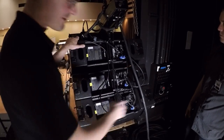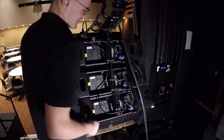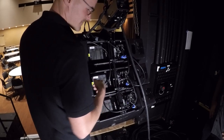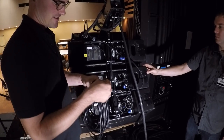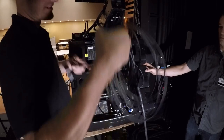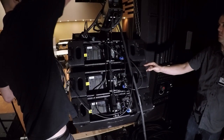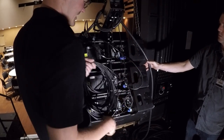Put it in, twist it, boom — we got power. We don't have the power hooked up yet, but the next step would be to fire these on. Switching them down is going to turn them on. It's always good to send signal to them too, make sure that they work before you raise them up in the air — because if you get them up there and they don't work, you've got to bring them down and figure out what's up. It's better to test them on the ground. To do that, we'll also run the main XLR that'll come out of your snake head. We'll do the same thing with the strain relief up over the top. So that's our main input — it goes in the top one. And then we're ready to daisy chain them down so it'll just pass all the way through.